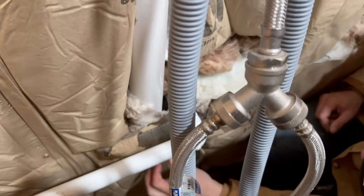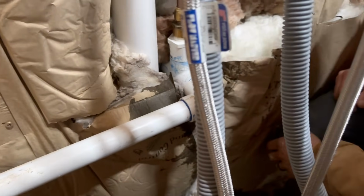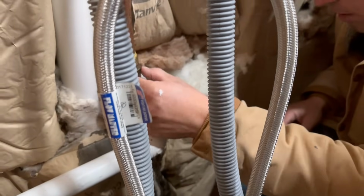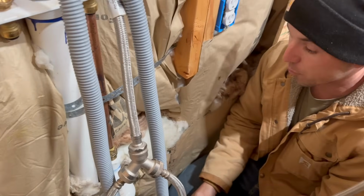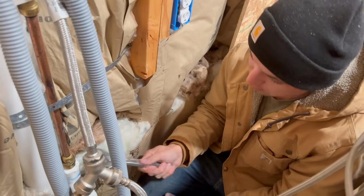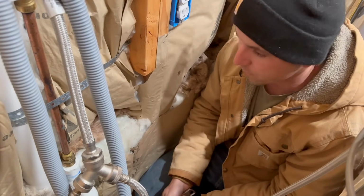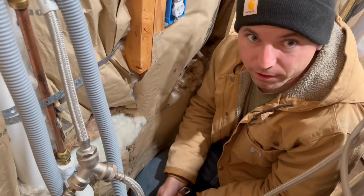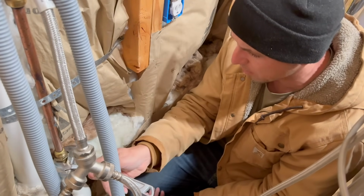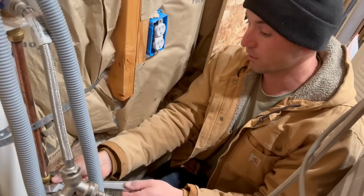Sounds like it's been leaking for a while. A little while, huh? It's this right here, whatever. This piece. For the washer? Yeah. Okay, well, I think I found the culprit. It's this brass to PVC pipe fitting. It's just like one of those insert fittings. I don't know if it froze and broke or something, but I'm gonna take it off right now. I've already drained the water out and see what's going on. And it was actually kind of loose, so maybe that was it. It feels like it hasn't been draining. I'm just gonna mess with it, figure out what I can figure out.